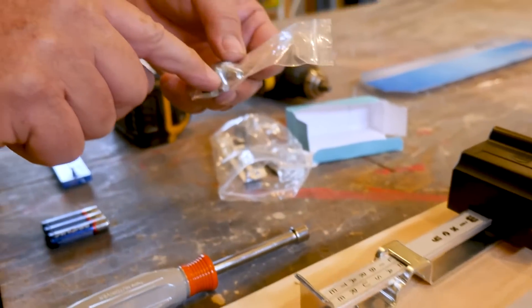The next step is to get the front scale and the indicator head off the display. In the back, you can see this whole item slides up and down, kept taut by a spring. Pull that spring off — it's easy to get around there — and now this rides free. Pull it up, pull it out of the indicator display head, and you have these two pieces. Set them aside, then chuck up the provided 3.5 millimeter drill bit. You have two holes already in the base plate, so go ahead and drill straight in.